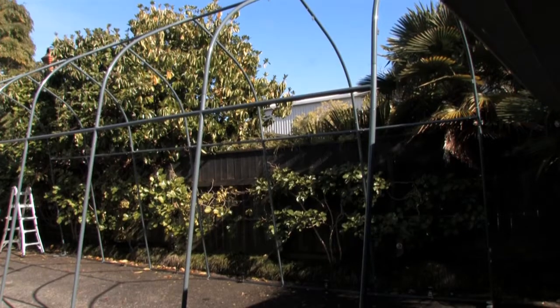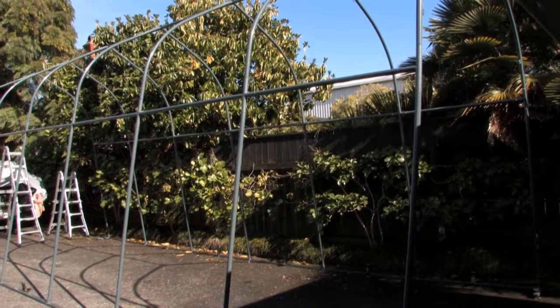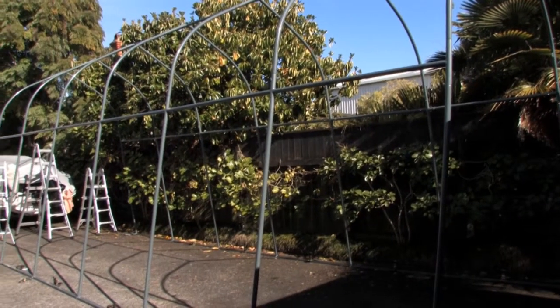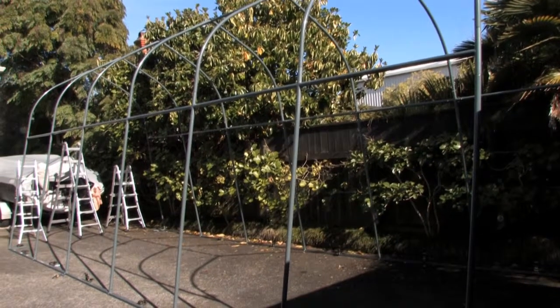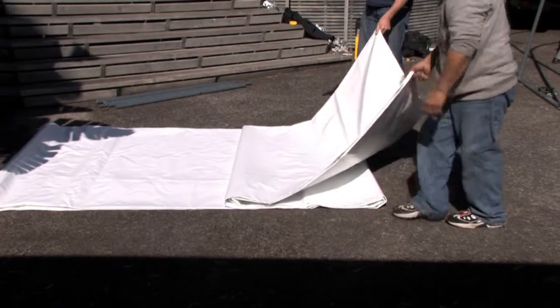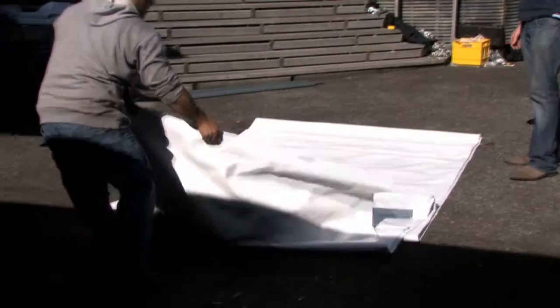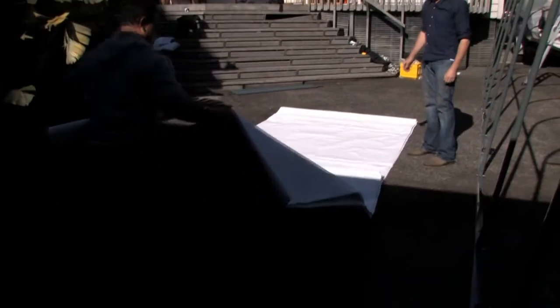This stage for larger shelters is easier if you choose a fine day and little wind. Always ensure you use secure ropes. Ladders will be required and a pole to aid the cover to slide over the frame. The shelter covers will be packed in three sections: door entrance with zipper, main cover, and wall cover.